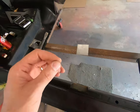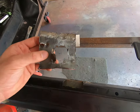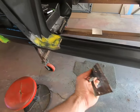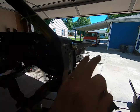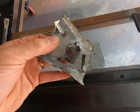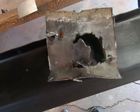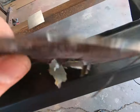The theory is always that something rusts from the inside out — not in all cases, unless you consider the inside the outside. These were galvanized; Chrysler liked to galvanize the inside of the rocker panels, even the undersides in some areas. If you look at this, there is literally no rust on the perimeter of where the hole is — there's a little bit right here, but that's from something else, from the seat mount.